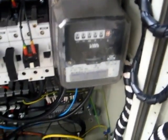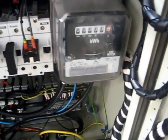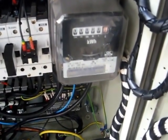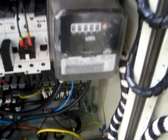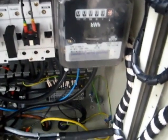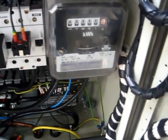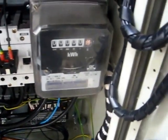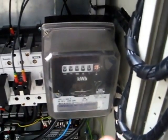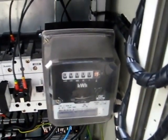I'm going to demonstrate, based on engine speed, that the grid can power the engine or the engine can push power onto the grid — purely based on the governor and engine speed settings. I'll show this meter going in one direction when generating, and then briefly going in the other direction when used as a motor.